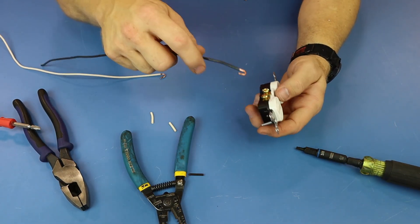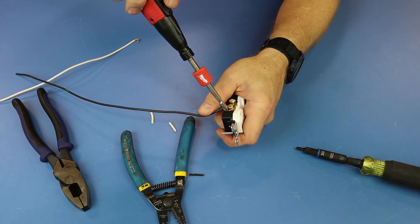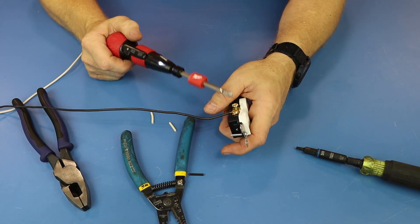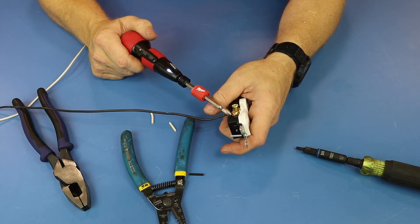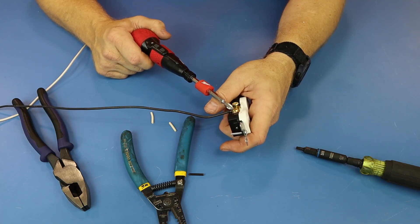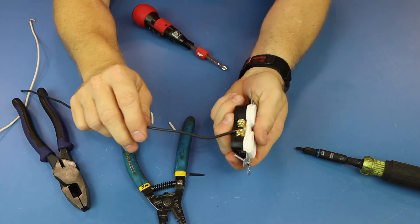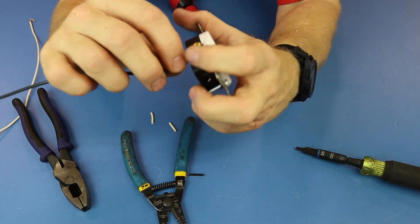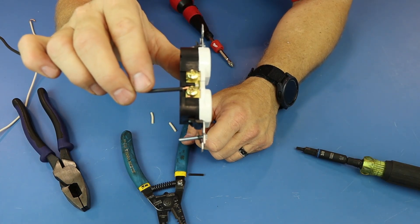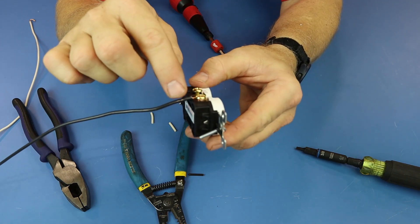Let's put them on. We know the black is on there. We're going to go ahead and tighten it down. Keep in mind this will only tighten a little bit at first — you'll have to tighten it more because that is not tight enough. As my students know, I go back and check their devices. You can see I can still get more on it. Do you see right here? Look at this insulation where it ends and where the copper starts — it is not compromised at all. It is where it needs to be.